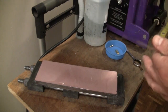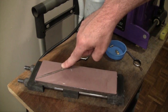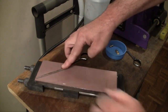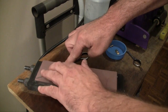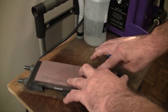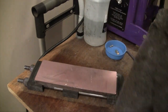I always do all of my work on the thinning shears before I do the sharpening — so we're going to start by working the inside. We'll set the shear down on the water stone and start by pulling the shear back at about a 45-degree angle, drawing across the stone. Put one finger over the screw hole, make sure the entirety of the ride is on the block, and make sure all of the shear is on the stone. All the pressure comes from over the hole. Do a few quick strokes, then come to a complete stop before you lift off — you don't want to come off with motion, as it's very easy to radius the inside of the shear.